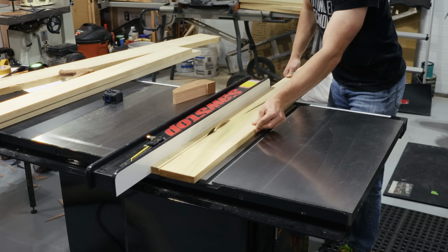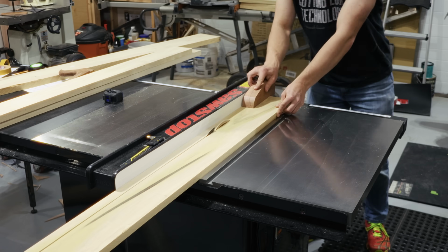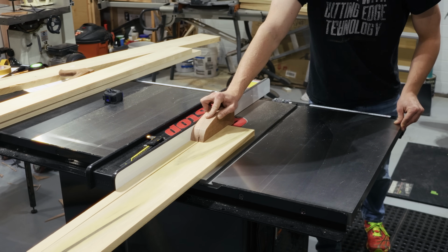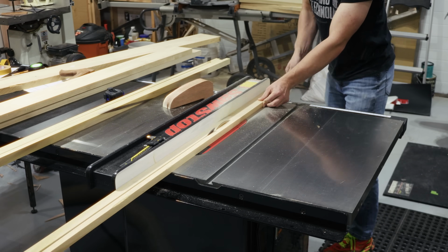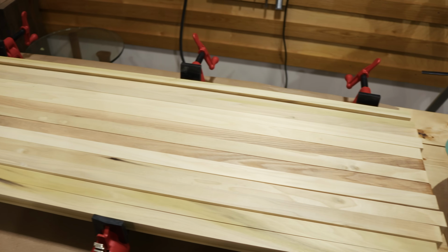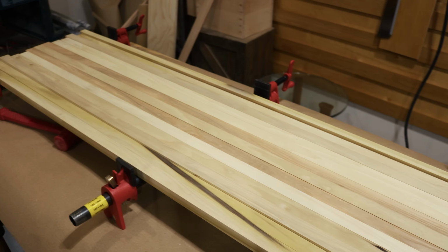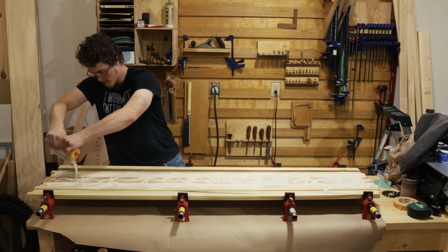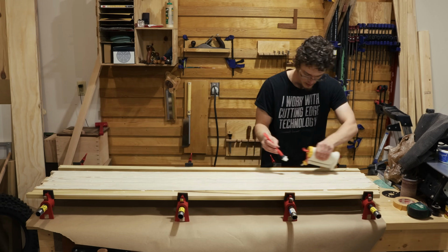The two most common materials are aspen and poplar. I opted to use poplar for the bulk of it since, well, that's all I actually had available, as well as 2 strips of ash, as you'll see later on. The core is constructed out of numerous strips rather than one wide board to minimize any weaknesses in the wood and create a more stable panel. With all of the strips cut out, I arranged them like this, with the ash pieces towards the center to give more pop when riding and increase stability underfoot.